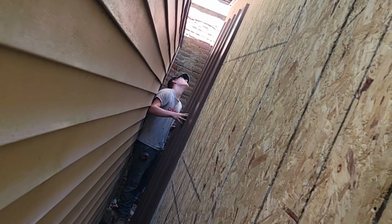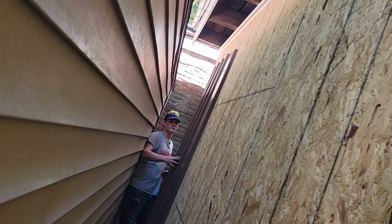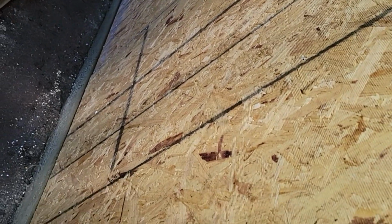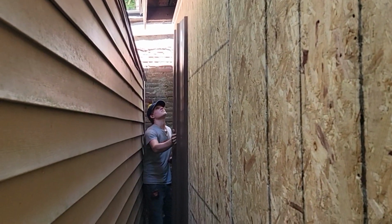Our building end is a little out of plumb, right? The bottom was kicked out almost 1 inch. Yeah. So we don't want the steel sticking out. We're going to put it up and level it up inside there and make sure it goes down past our sheathing. And then, you know, the concrete, we don't care. So lift it right up in there.